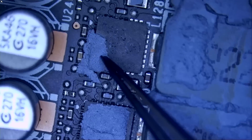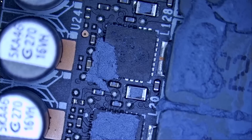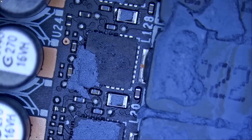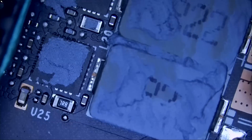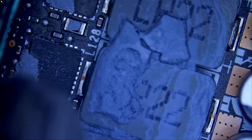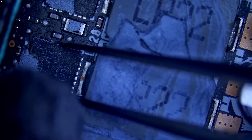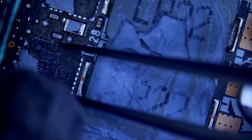Now we have to apply hot air to remove this chip. If you notice, we have an aluminum capacitor right on the left of that chip, and those caps do not like heat — they will pop. So we're going to cover that cap to shield it from heat using something metal. I call it MOSFET; it's technically called DR MOS. Some people in the comments say it's not a MOSFET — just relax. For the sake of simplicity, I call it MOSFET. Calling it MOSFET or DR MOSFET isn't going to change anything. The card is still not working.